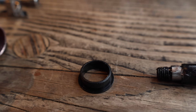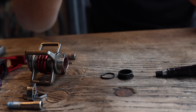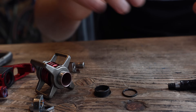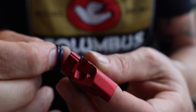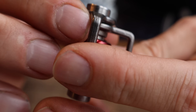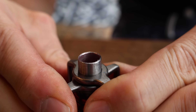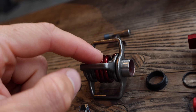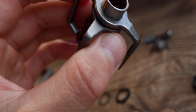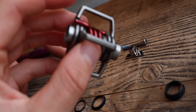Have you ever taken one of these apart before? No, we've just been told that it's possible. There we go, there's a bit out, and there's O-rings in there. Actually we'll go this way around so you remember which way to put it back in. There's a bushing in there and a seal — that seal comes out the side. So that's all done in there. I'm assuming that'll come apart as well but I'm not going to mess with that today because that spring is quite tight.